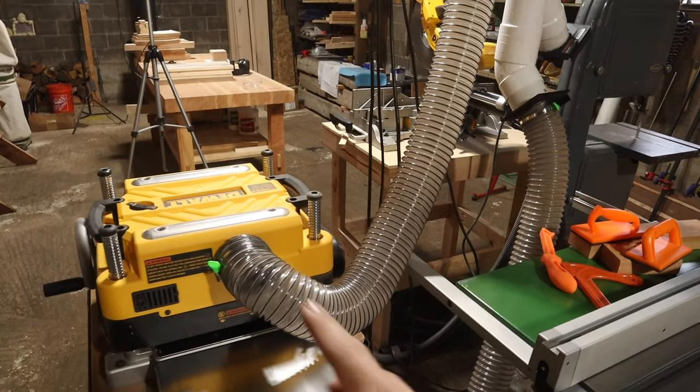And so you want to go through, measure how high you can reach, and then you want to make sure that you put a spacer long enough in there that you can actually reach these. And that's why this guy looks like he's off kilter as well, because I wanted to get him as high up as possible, but I rotated the blast gate down around a little bit so I can grab it a little bit easier when I need to open it up.